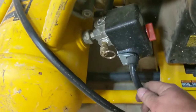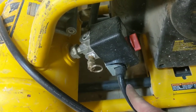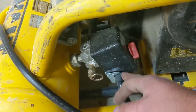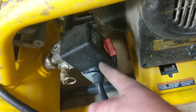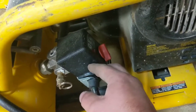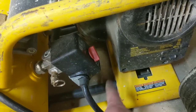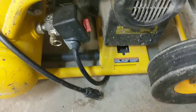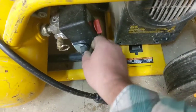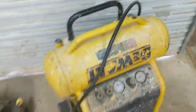Right here was probably my biggest problem with this unit — the cord. I've replaced the cord twice, and I've had to undo this box. There's only one screw that holds it on right down here. You take this box off and reseat the plugs. The three wires that go inside to the connector are just slip-on plugs. Going on job sites, I'd plug it in, nothing would happen, and it ended up being that one of those wires had come loose. They really need to redesign this to where it doesn't wiggle as much. But it's a good air compressor — I use it on job sites all the time and it works like a champ.